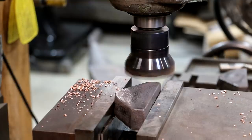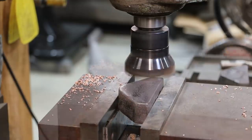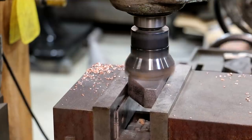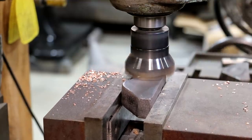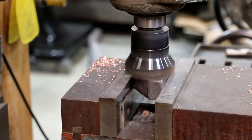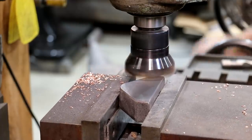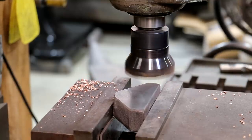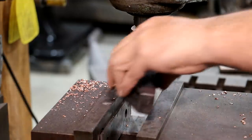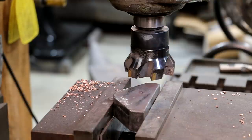That 10 thousandths did the trick. We'll put our other piece in there and get it cleaned up as well — that side looks like it cleaned up too. Not a lot of irregularities on that surface. We got the shrink on the other side. These parts need to be one inch thick and I'm basically starting out a little over an inch — about 200 thousandths over. So we got 200 thousandths to take off more or less.